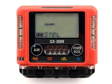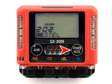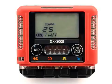To increase or decrease the numerical value of a parameter, use the Air button to increase or decrease that value. To accept the value, press the Power Mode button. The screen will now show the current TWA setpoint for the CO sensor with the setpoint value flashing. To increase or decrease the numerical value, use the Air button. To accept the value, press the Power Mode button. The screen will return to the CO sensor selection.